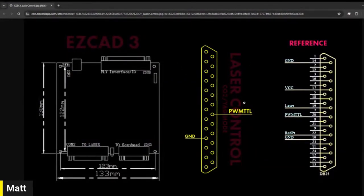So in case you guys just got here or you missed it, basically this is what we've got going on for the laser control board, and he is trying to move them for the digital for the UV laser so that it can be read from digital. It's going to be moved from the pulse width modulation over here on 20. He's moving it down to 22, like you talked about. And then the ground, what are you doing with that one? You're leaving it on nothing. I'm just resoldering it because it was worse than how I would have done it. Which is saying something. There's a lot more things going on, but those are the two that we're looking for. So that's what's happening.